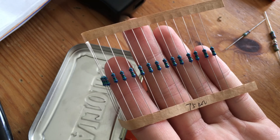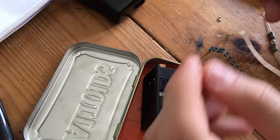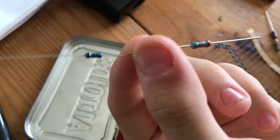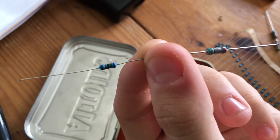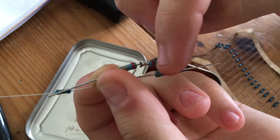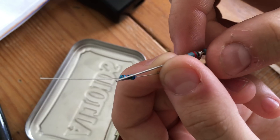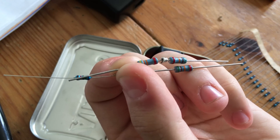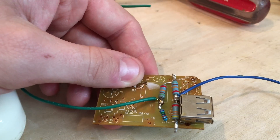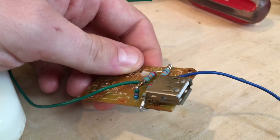I went ahead and found the 75k resistors, and I'm going to combine it as the pull-up resistor with a 51k to make the data minus resistor network. I'm going to solder both of these together and solder leads in the middle which is where the data wires are going to go, and test it out. If you're having any difficulty following any of this, just look at the schematic. Now that we have the resistor networks in place it's time to solder their leads to the USB port.